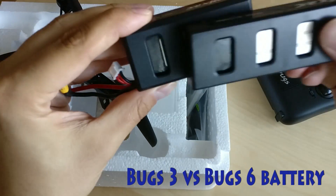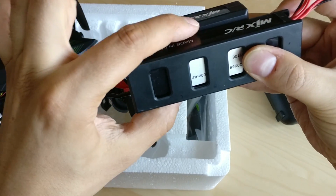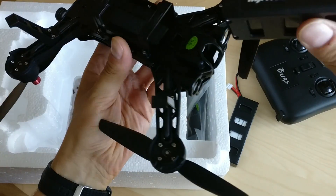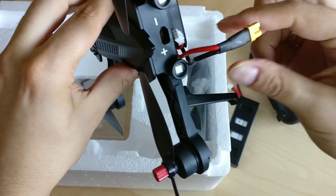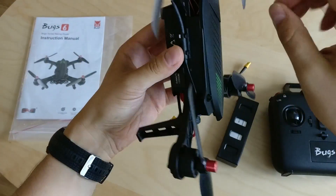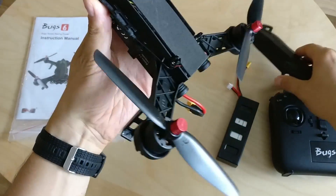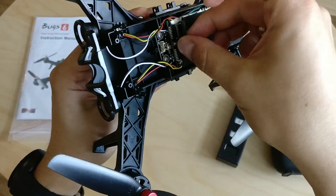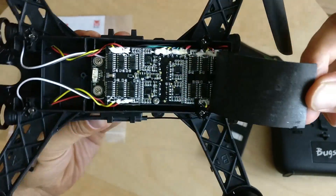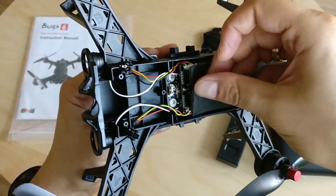You will notice a lot of similarities with the B3, and apparently many things have improved. Batteries are different though — the 1800 B3 battery has the same connector and same voltage, and adding some foam or other sort of stabilizer would let you use it. You don't have separate ESCs; on one side this is good — you just replace the whole ESC board and you're fine. On the other side, that costs. At the time of making this video, there was nowhere a listing with the ESC board, so I can't really say about the pricing.